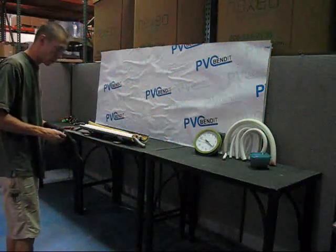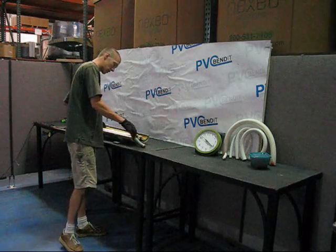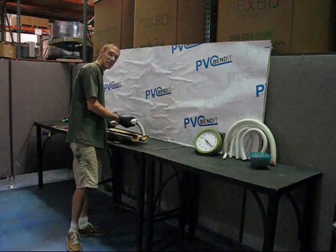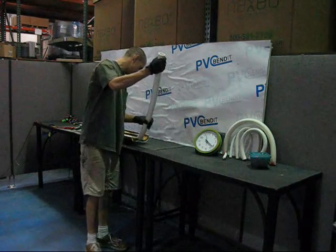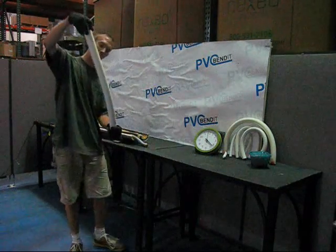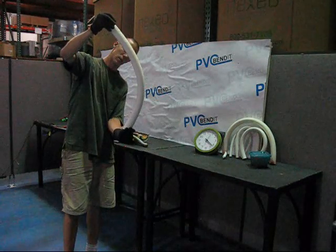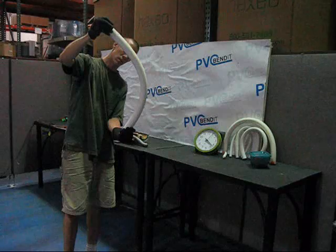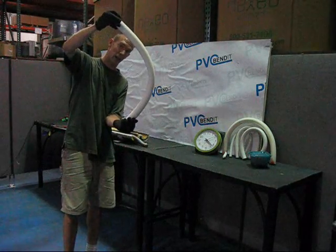One and a half inch pipe right here. Switch to a B-sized high temp bender. To begin with, here's the bend with no internal support. You can do this stuff really fast — I'm just going slow for the dramatic effect.